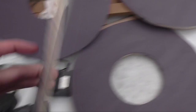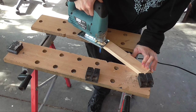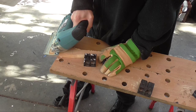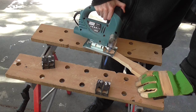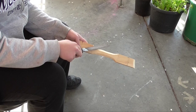To create your handle, first take your piece of wood and cut it to length, measuring it against your shield. Then mark where the central hole lines up with the handle for future reference. If you're creating a rectangular handle, you may want to taper the central part to better fit your grip, cutting it to a square section which widens at the top and bottom to prevent your hand from slipping. Cut the end at an angle such that it meets smoothly with the wood on either side, then cut the corners off the central part of the grip, bringing it closer to a circular shape. Sand the handle smooth using either a file or heavy duty sandpaper, testing it as you go to ensure it snugly fits the contours of your hand.